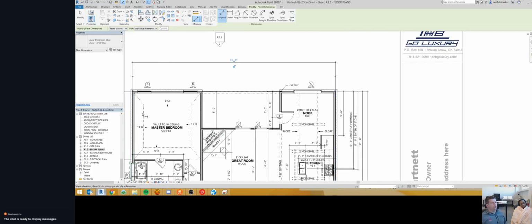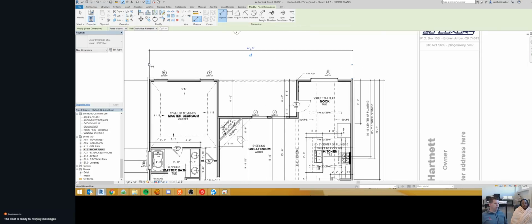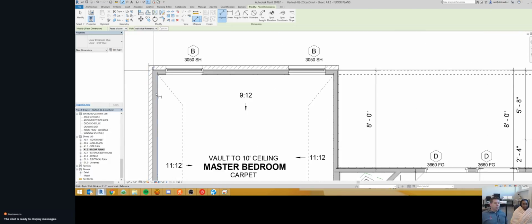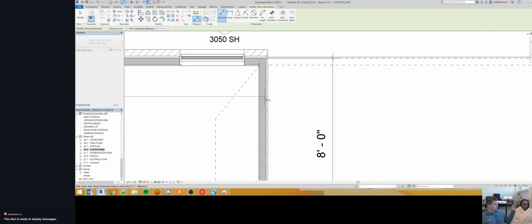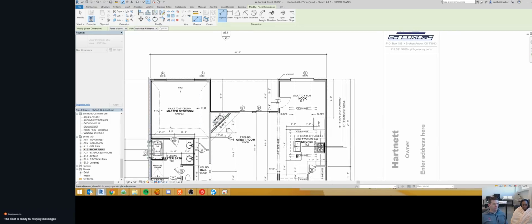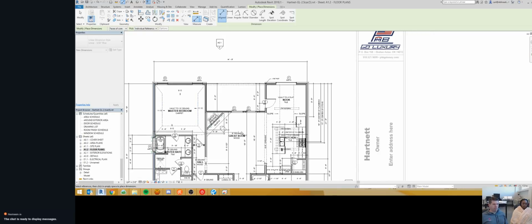All right, so the next thing I want to do is, what you have to remember is you're giving somebody instructions on how to build this and where to lay things out. So we have the slab plan, which the concrete guys are going to reference, but they might also reference this to verify other dimensions. First of all, we give them the overall size so that they know how wide on the lot it's going to be. And then we give them the segments of the building. We have 3 segments here. We have the public wing, the living area, and, I did that backwards, the private segment, the living area, and the public segment. It's not always private, public, but you can see that there are 3 distinct pieces here.